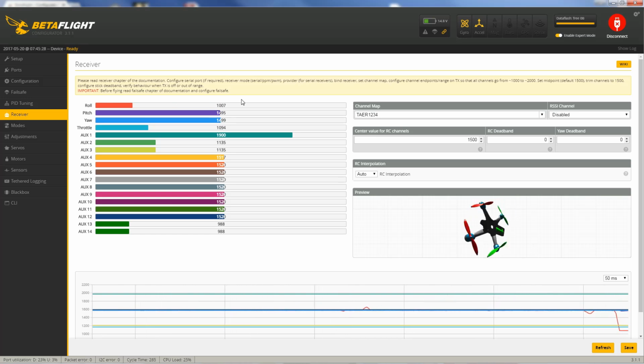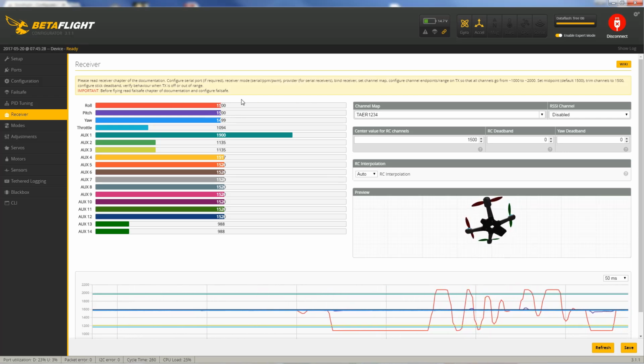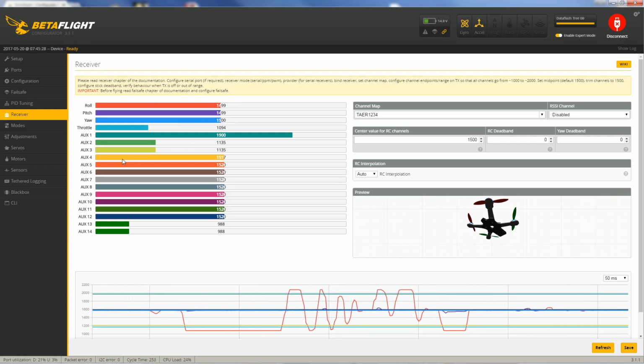And then your channel throws, you want to increase those so that you get close to 2000 on the top end, and then 1000 on the bottom end. And I do that for pitch, roll, yaw, and throttle. I don't worry about it for the aux channels. It's not as important for those, but I do that for the main four.